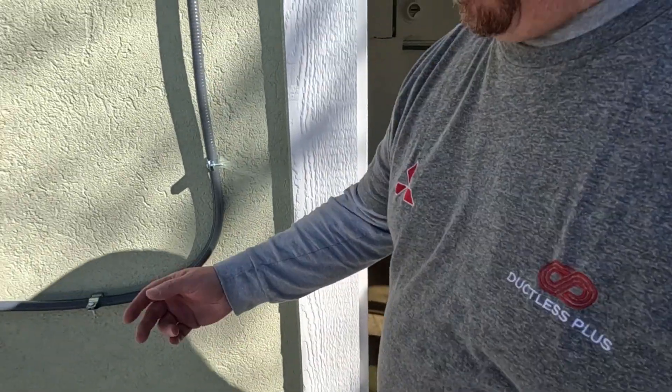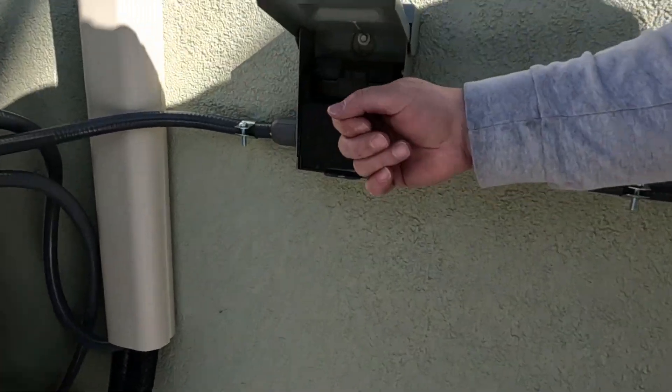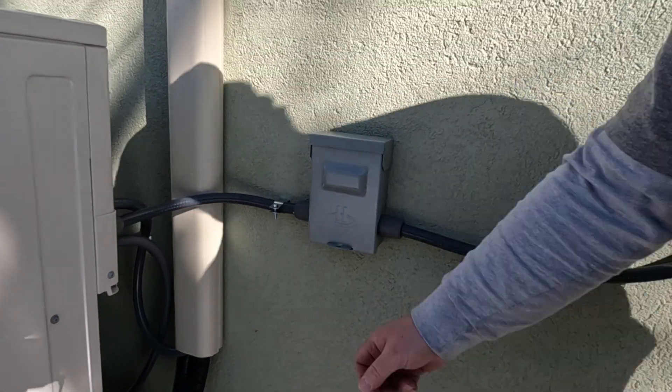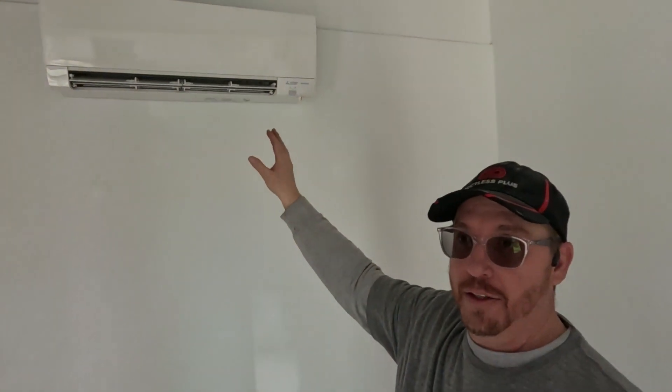If you ever need to come and turn it off, you just simply lift this, pull your service disconnect or put it back in. Here's the unit right here. The lady is going to have several people living here, so we did not give her the remotes. When you're going to have a tenant in a house, don't use the remote — just get an MHK2 thermostat. It's fixed on the wall, it's permanent, nobody's going to take it. You do need to put batteries in it occasionally, and it will give you a low battery indicator on the screen.